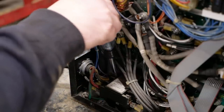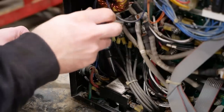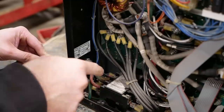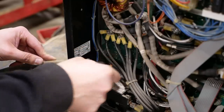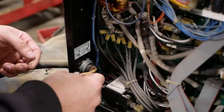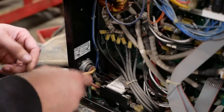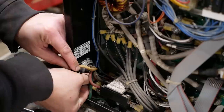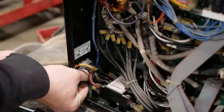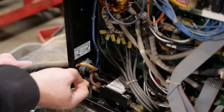It appears to be super simple to set up — that's the nice thing about these inverter machines. They pretty much run on anything. This machine can take anything from 208 to 460 volts, single phase, three phase, 50 hertz, 60 hertz — really doesn't matter. The beauty of the inverter welder is that they just take the AC incoming power and rectify it into DC anyway, so it really doesn't care. All we have to do is pull that jumper off of L2 and connect it to L3.